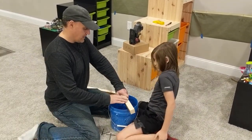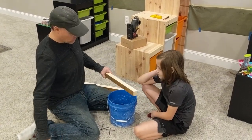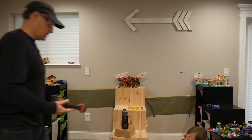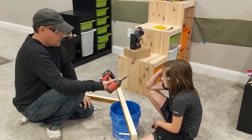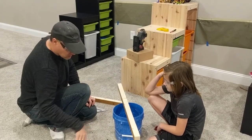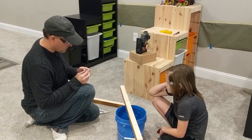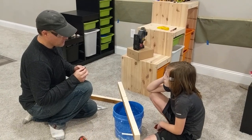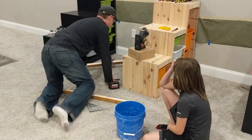Since this is wood it's not as critical, but it's still a bad habit not to be wearing safety glasses while drilling. Do you remember the name of this tool? It's an impact driver. What shape of bit is in here? Phillips — you know because it looks like a plus. I'm not a huge fan of Phillips fasteners. I prefer Robertson or Torx — both are superior to Phillips because they don't cam out, they don't jump out of the fastener.